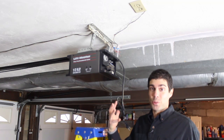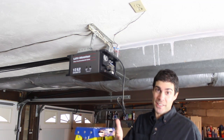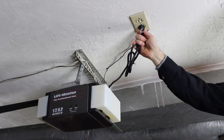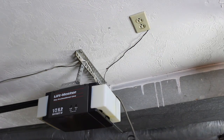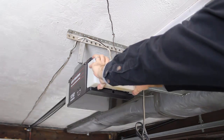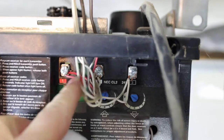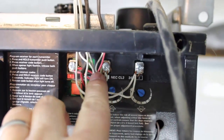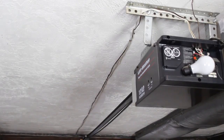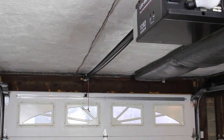If you already have a garage door opener, you're going to have to remove the old one before you put the new one in. Unplug the garage door opener by pulling the plug from the outlet and pull the light cover off — that will reveal the wiring and the light bulbs. This looks like a little bomb, but you want to take a picture of this because those wires, which run along the ceiling here, attach to different things.